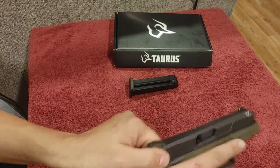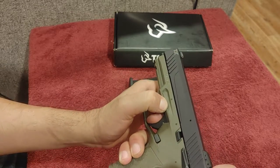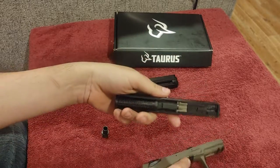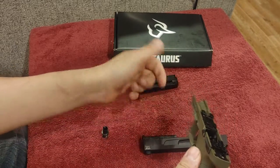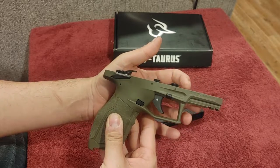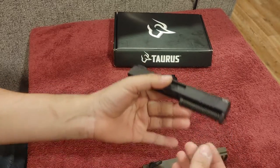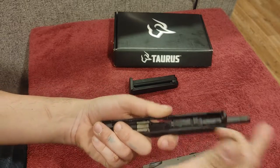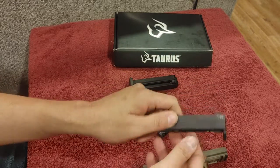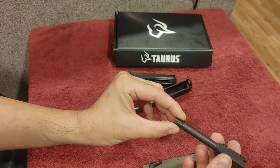Let's take her apart. Safety check — nothing in it. You're going to have to drop these two tabs — well, technically it's one tab. Pull the trigger and then you can pop the top off. It doesn't have to go very far forward; it comes forward just enough to lift off. You'll see one difference between this and a lot of .22 guns like Chiappa 1911 or Beretta clones: this one does not have a fixed barrel. It is contained within the slide, much like a standard gun. Captive guide rod — it is plastic, but it is rebuildable, so if you have a spring failure you can change that out. Your barrel is very light and small, but constructed very well.